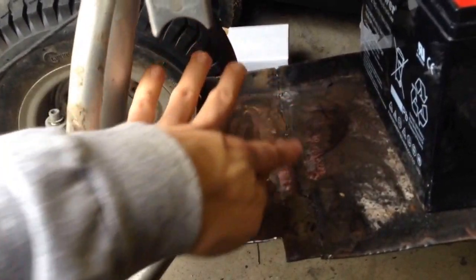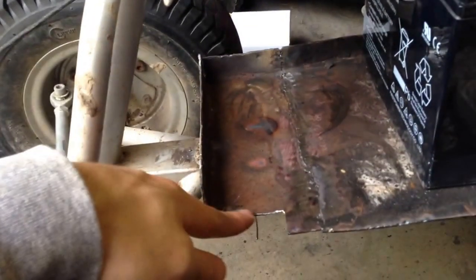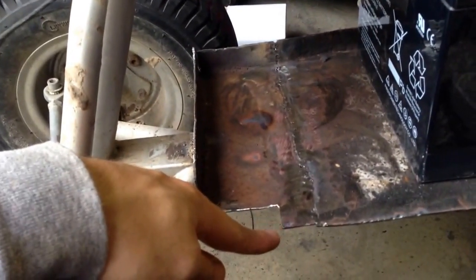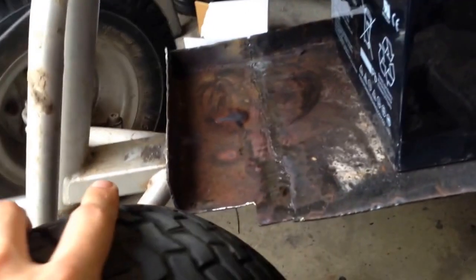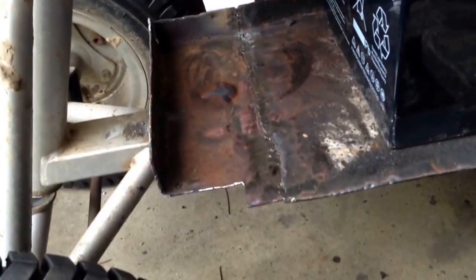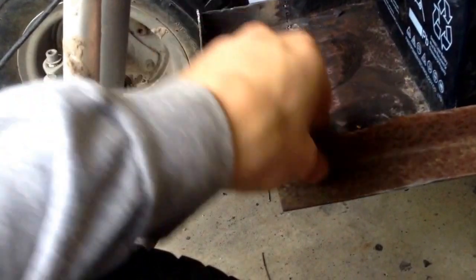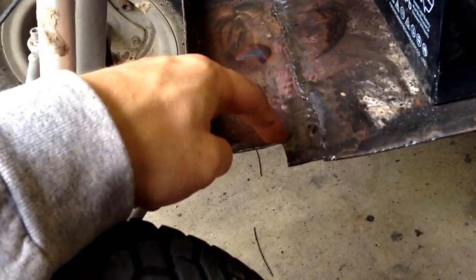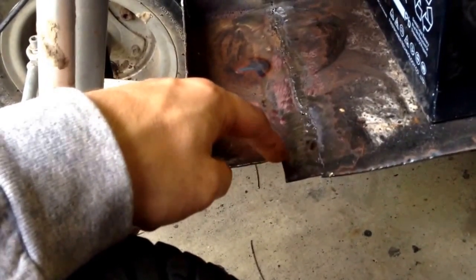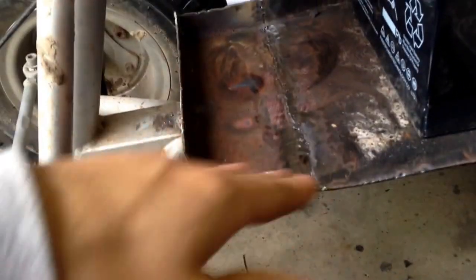Just a piece of flat sheet metal that I bent and made kind of a tray, then welded the two together and ground it back down. So you'll have three batteries sitting in here. This one is cut out for clearance because of the tire — see? But the battery will sit flush to here; the battery doesn't stick out further. This extra is for my angle iron piece to mount. The angle iron piece will come all the way out to here, but I'm going to cut a piece out of it so the side will just continue out. It'll bolt here, and the side of it will continue on to cover up the whole side of the battery. That's how the tray is going to work.